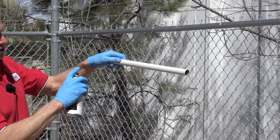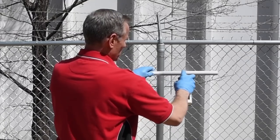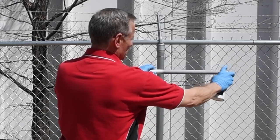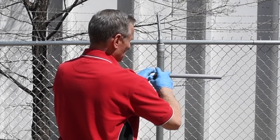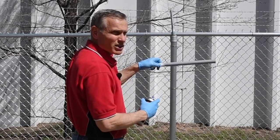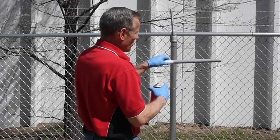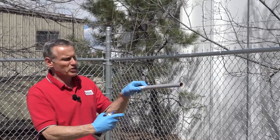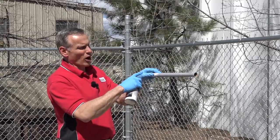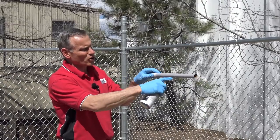That's why I wear gloves. I continue to rotate the tube even while it's still wet so it doesn't drip until the solvents evaporate. I want to put this on in light coats but build up a pretty thick layer to fill in all the spirals, so it's going to take several coats. I'm looking for the tube to lose its shine — once it loses its shine I can go ahead and spray the next coat.